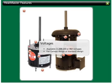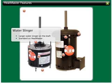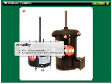Heatmaster motors are available in the common voltages for residential and light commercial applications. They are also available in fan canopy models. Note the larger water slinger on the shaft — this is standard on the Heatmaster motor. Our popular 4-in-1 motor is also available in the Heatmaster series, giving you the versatility of a multiple-horsepower motor with all of the Heatmaster features, available in both the 825 and 1075 RPM versions. This is really the best truck stock motor you can buy.